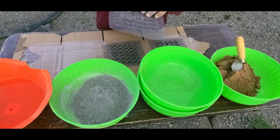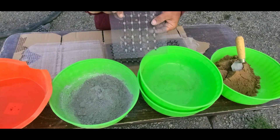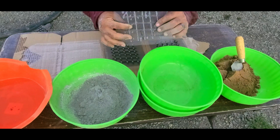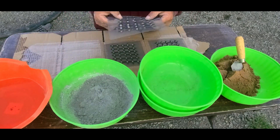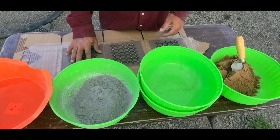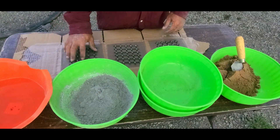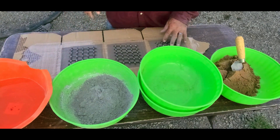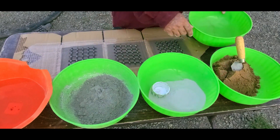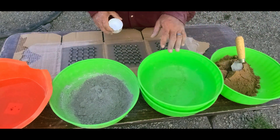I'm going to be mixing that up. I pre-made these meshes — I glued this basalt mesh onto this fiberglass mesh because it was buckling and I want to make it really thin with no high spots. You always want to mix the cement and apply it to something, so I'm applying it to these meshes. I just have a piece of cardboard with tape on it so it'll come off.